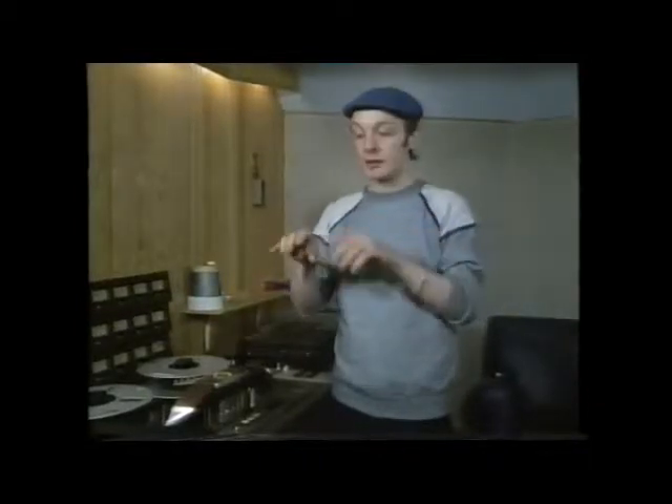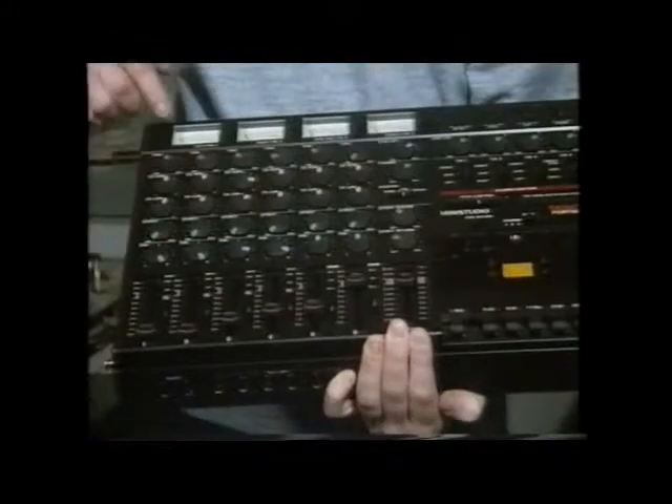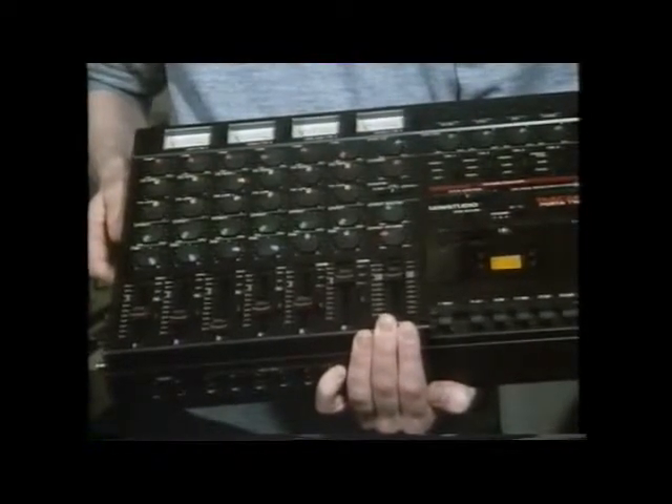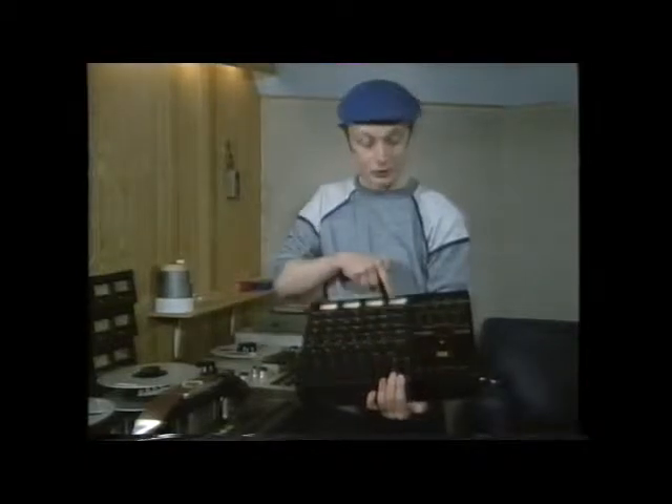The 24-track tape recorder is wonderful, but you don't actually need it to make good home recordings. All you really need are two cassette recorders - you do what's called bouncing the sound from one to the other, adding extra instruments along the way, and that way you build the sound up. But if you're lucky you might be able to beg, buy, or borrow one of these - a complete four-track studio. It's got a mixer, meters, and all the things for building your tracks, and it just uses a standard cassette. Nowadays they've even got mini versions about the size of a large video cassette, and they're pretty good.